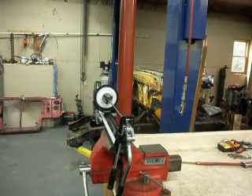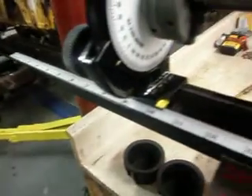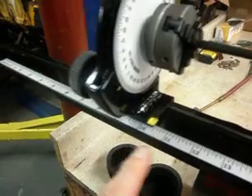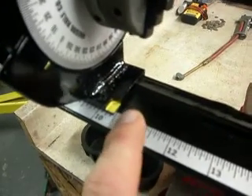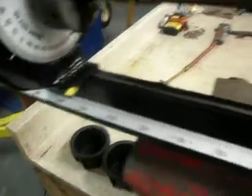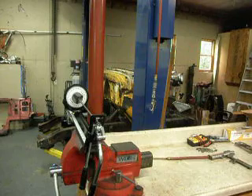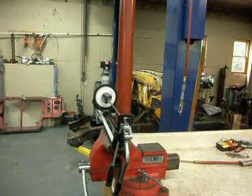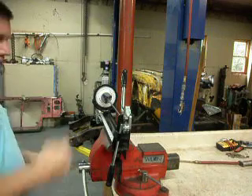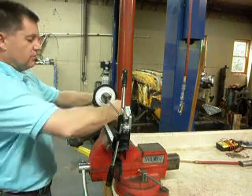Let's walk through that process. I've got myself set up. We're going to start by putting the protractor on zero on the dial. This is a 16-inch piece of tubing, so the bed overall is 24 inches. I'll start at 10 and a half, reading off the front edge of the trolley, and the tubing is set on zero on this dial. The first step is to come out exactly an inch and a half — loosen up the thumb screw and come out one and a half inches.